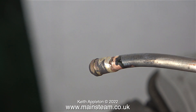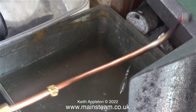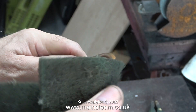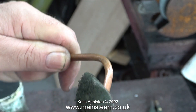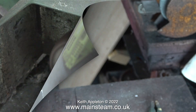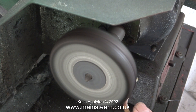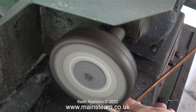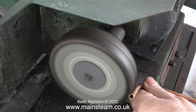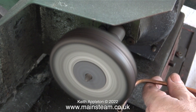This is just a gratuitous shot of the part cooling. The next part of the job, once it had cooled slightly, was to dip it in the tub of water. The thermal shock dislodges some of the oxidisation. No acid bath this time — first I clean the part with a piece of Scotch-Brite, then I use my polishing spindle to clean it up thoroughly. This is not just a cloth wheel; it has some abrasive soap applied to it, which really cuts through the oxidisation and gives a very good finish once the job's done.